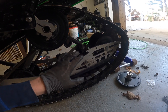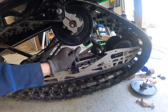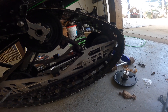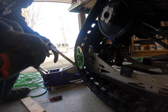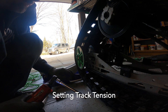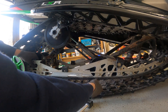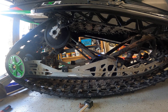If that happens you're probably gonna need to take out your main torsion spring and use a ratchet strap to try to pull it back — it sucked. I did all that off-camera. Now it's back in and I'm gonna slap this thing back together. We're going to tighten up the track tension — I don't have an official 12-pound weight, but you want about an inch of sag, so I'm just going to tighten this down and see how it does.